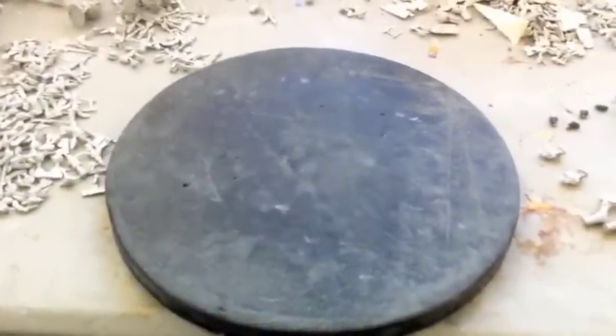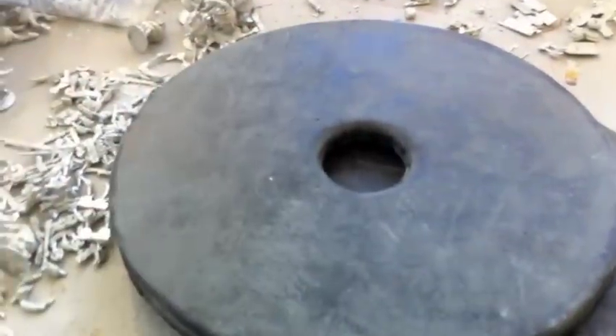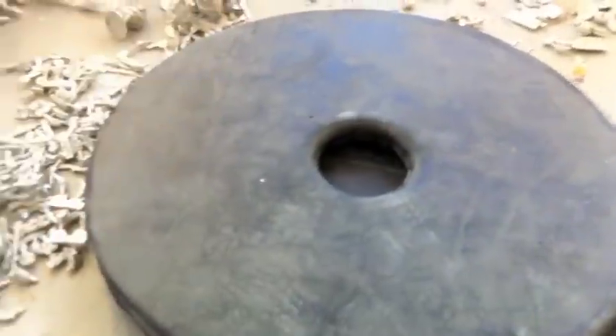All the molds I make, I make with black organic rubber. They come in two pieces. This is the bottom, here's the top. You can see it's got a hole already pre-poked in here, and then I've got a prior vulcanized chunk of rubber that fits in there, but you'll see that later.